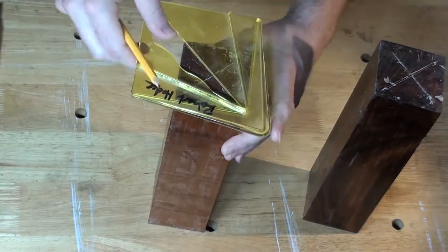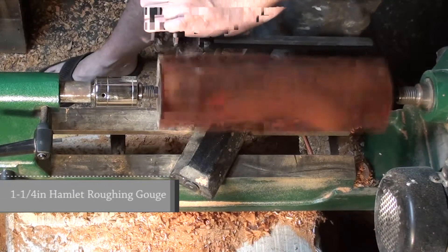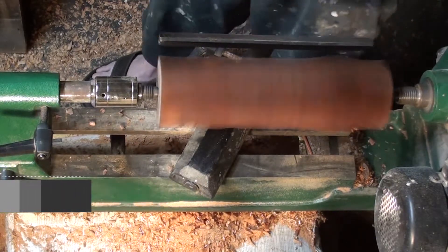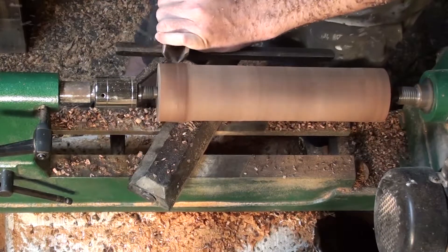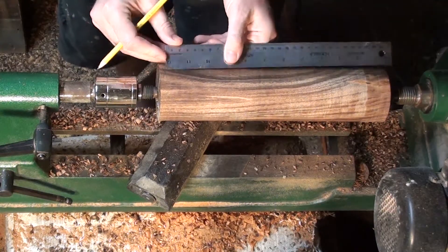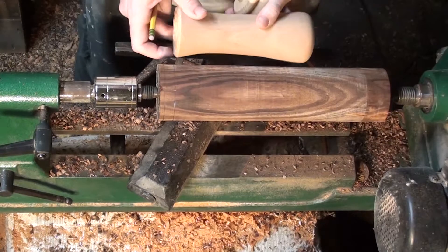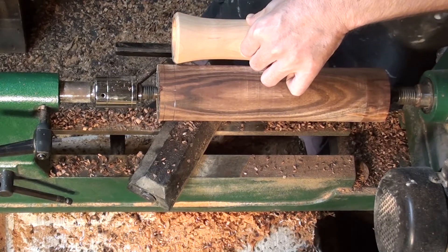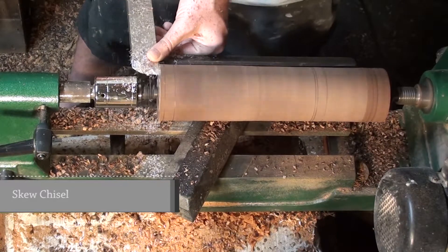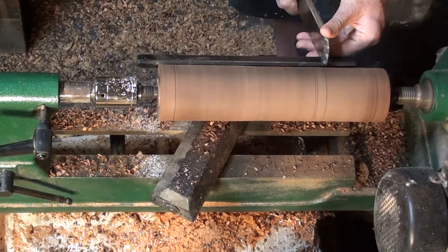When I decided to turn these two pieces I started with the cherry because it's been a while since I've turned a pepper mill and I didn't want to mess up on the more exotic wood. While putting together this video I decided to put the rosewood blank first, but the cherry grinder will be at the end of this video as well. I'm now marking where there will be tenons and the high and low diameters of the pepper mill. I'm holding up my cherry mill blank to get an idea to make a fairly close to identical pepper mill blank. I'll be adding three tenons that can fit in my chuck — one at each end and one at the top of the body of the pepper mill.